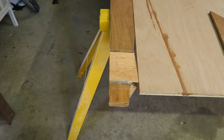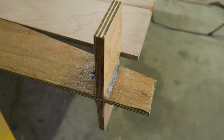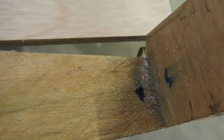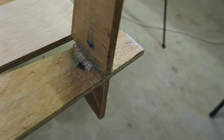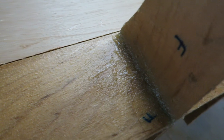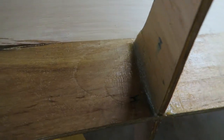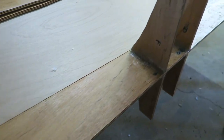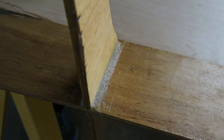We've now done this side — they've got a nice simple little curve on them. I just did this with a paddle pop stick to round them off. They only really need a curve so the glass sticks and you don't have a hard right angle — it doesn't have to be a beautiful curve because it's all going to be glassed over anyway, which will present a much smoother finish in the end. This thickened resin is effectively acting as a glue to hold them in position and give us that curved edge.